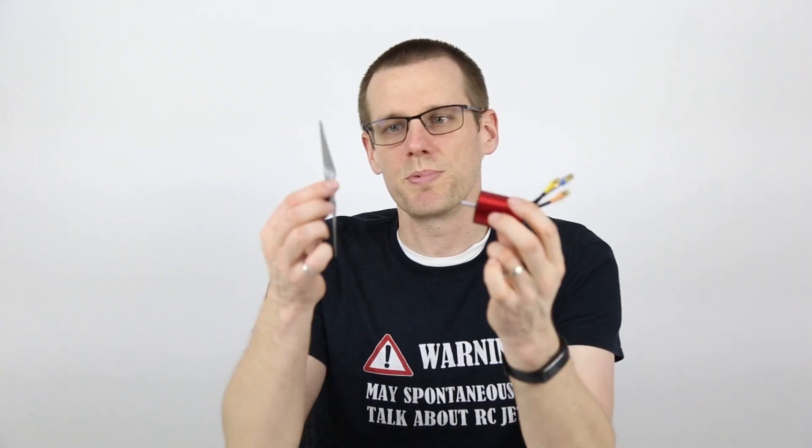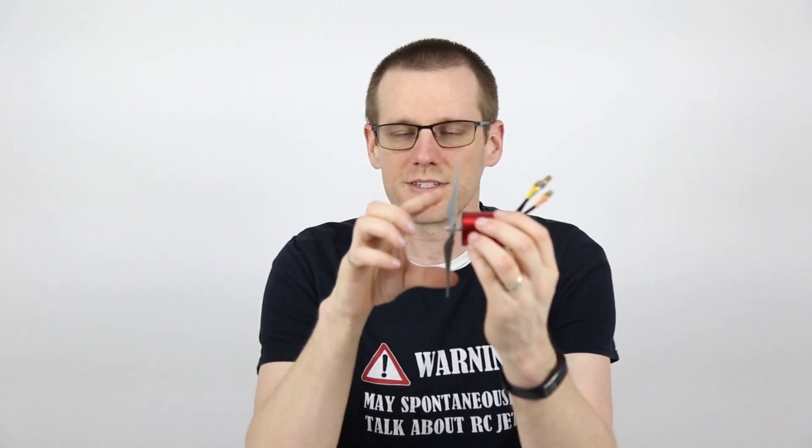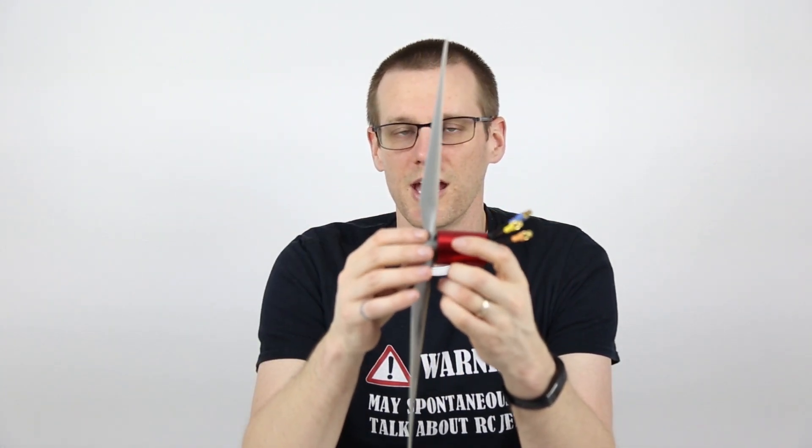For illustration purposes, I grabbed this small propeller and placed it on the motor. This propeller would actually push this motor up over about 60 amps of output power, which you can see by entering the specific propeller size — I believe this is a six-inch propeller — plus the motor specifications or selecting the exact motor from a drop-down menu. If you were to try that calculator with a larger prop, you'd see it could easily exceed 200 to 250 amps. If you tried to place that large propeller onto a motor spinning 30-something thousand RPM on just 7.4 volts, this is not going to work well — the motor would definitely burn out in less than 5 to 10 seconds and you'd be left with nothing but a paperweight.